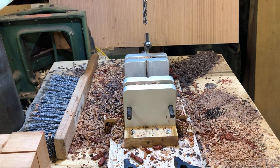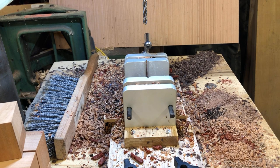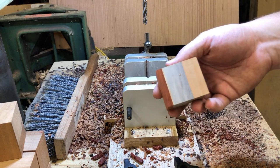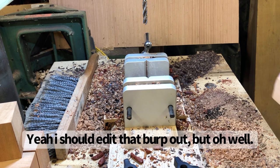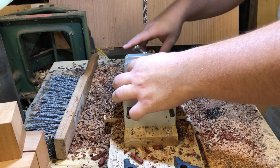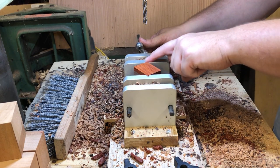I've got some cherry blanks — just plain cherry. I also have some random laminated blanks. These are actually off cuts from my cutting boards, and I hate wasting material. When they're the perfect size for a stopper, you just cut them down. I'm going to take these and drill them into stoppers. To do that, it's just a repeat of the same thing — I'm going to line this up in the vise and get it flush with the top, because instead of having it set all the way down, it's going to set flush.